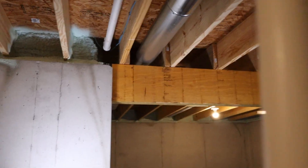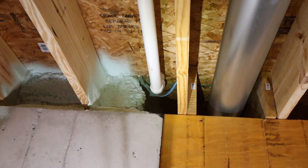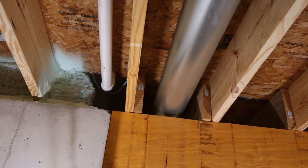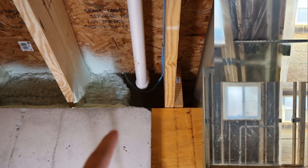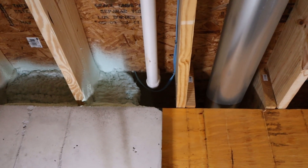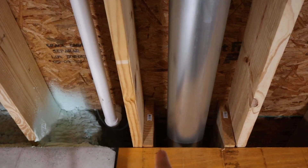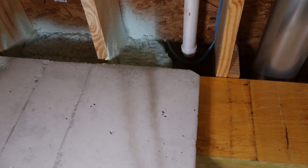Now that I got everything done over here, I ran the ethernet to my little temporary office as of right now, but it'll be nice to have a port up there anyways. There's kind of a wall upstairs that comes out maybe a foot and a half, two feet that way. According to pictures I have from when the house was being built, right from this pipe here maybe six inches to the right there should be open stud pretty much right above this ductwork. So I'm thinking I can squeeze a hole in right about here — as long as I get under the stud, I should be fine.